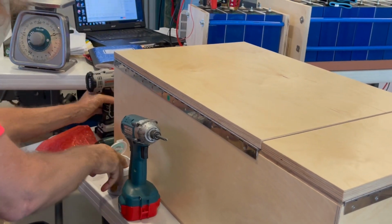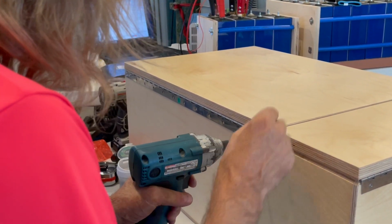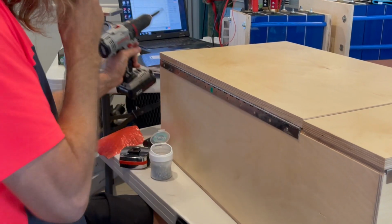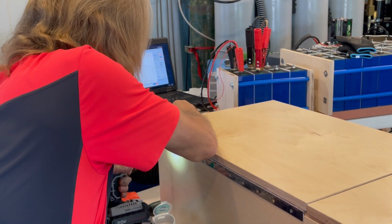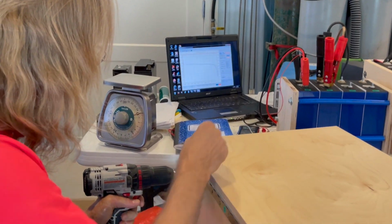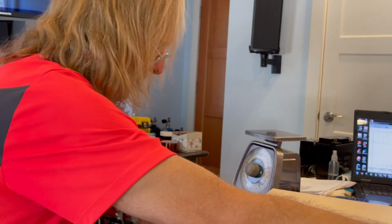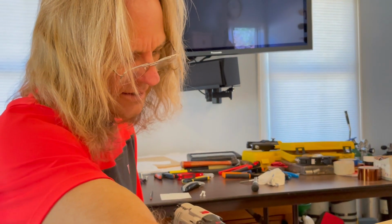There's a few things I forget to tell people on these videos. And I remember I did a video not too long ago about using a hydraulic crimper to put the lugs on the wires. And I have seen this mentioned several times, that these crimpers that we buy are for metric wire. They're for 22 millimeter and 35 millimeter and 50 millimeter wire, but we're using them with American wire gauge size wire, and there is not an exact conversion.